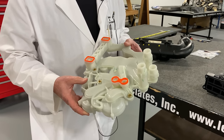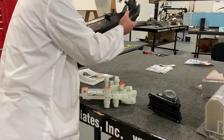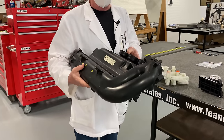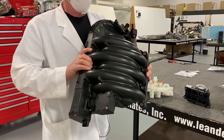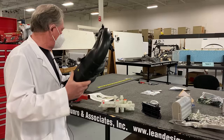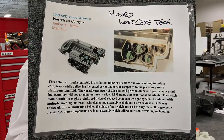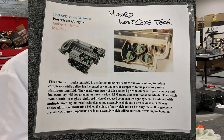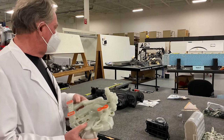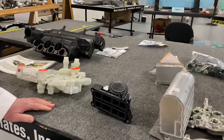This would be a draft point right here — not possible to make the mold move out of the way, so sometimes you'd have slides and lifters, but this would just get too complicated. Now, this is a good idea for what they've got, but it's not the only idea. This intake manifold from around 1998 doesn't have any extra parts glued to it — it actually has butterfly valves encased inside. That process is called lost core technology, and this product here won the plastics award in 1999. It was a BMW product we worked on.